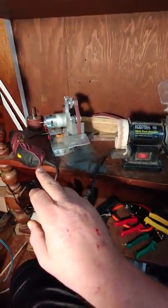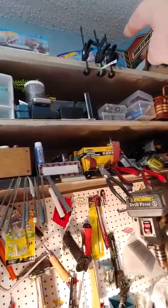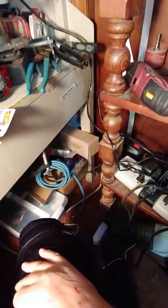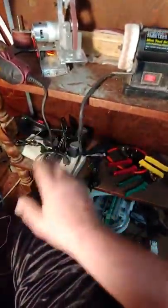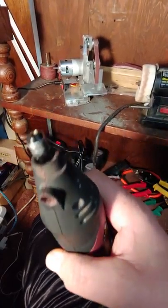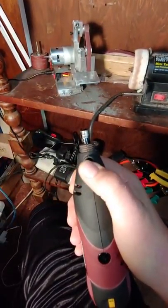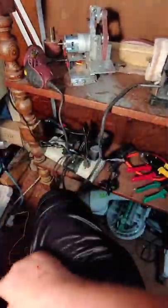There's a mess of wires there. I've got my plug-in Dremel, a grinding wheel, and my minivac. I've got my drill press and this light I'm using on the workbench. I've got some lights up top — a street light and a railroad track light that flash. My air tank for my airbrush is plugged into that outlet, and this hose — I just bought a new one because this one's broke. You can see my battery for my wireless Dremel and the corded Dremel. I keep burning tools up — this one's sheared off the little lock pin because it spins so fast. When you're cutting metal, you heat that little tool up and the shaft either bends or breaks off. So I've got to keep using the cordless.